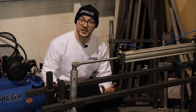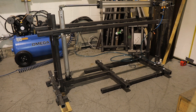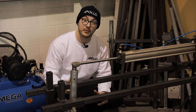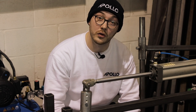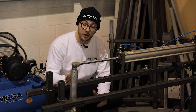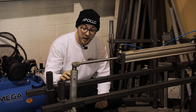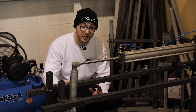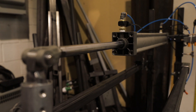This testing rig is completely different from the other one. In this one, we are testing the solidity of the stem and the folding mechanism. In this particular situation, we installed the old folding mechanism with the flat hook in the front because we wanted to see the difference between the old flat and the new hook that we showed you in the past video. And yes, there was a major difference — you can now see there's a gap creating when it's pulling on the stem, and this is due to the hook bending because it's not thick enough.